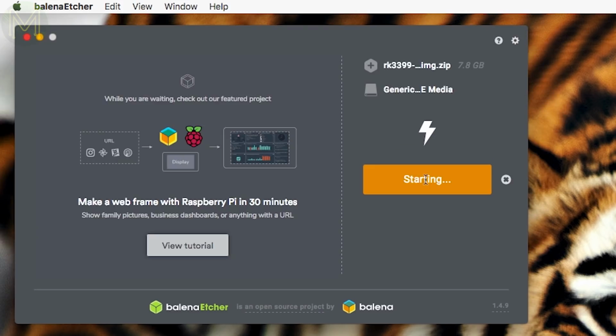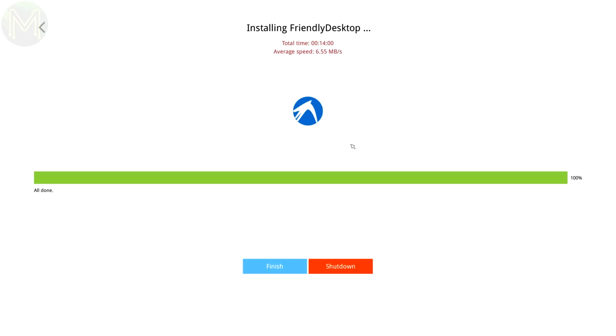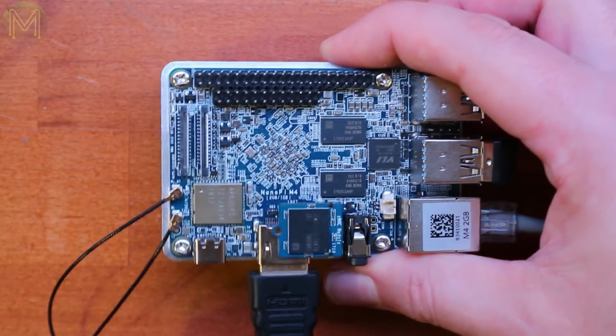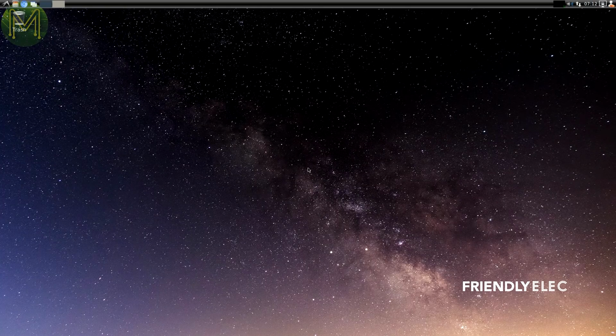Actually, it was Friendly Arm's modified version, but hey, the same thing. I followed the same process as before, burning the whole shebang to SD card, booting, and reflashing the eMMC with the image. Then shut down, took the SD card out, and powered back up again. Easy. So I thought I'd try a few subjective tests just to see the overall desktop experience.